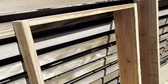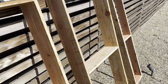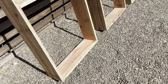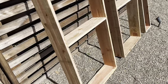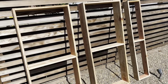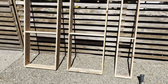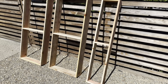First step would be to either paint or stain all of this lumber before cutting and building this project, unless you're going to go ahead and spray it with a paint sprayer. So the first step for me was to build these rectangular boxes. They're very simple and easy to put together. They're the top shelf, bottom shelf, and the working shelf of this project. I will have a full cutting list for you later on in the video, but for now we're going to go ahead and skip this step.